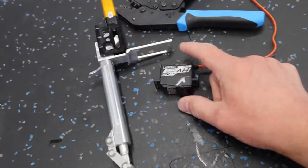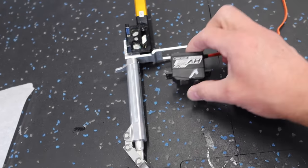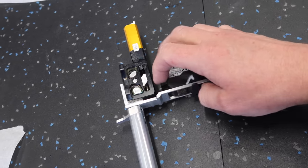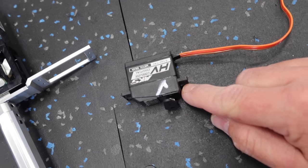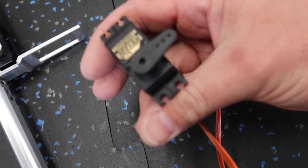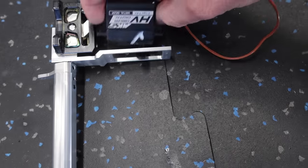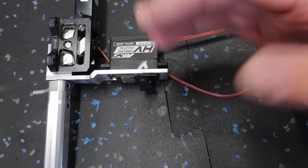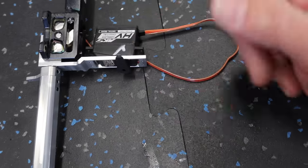And we are also working on our nose servo, steering and everything. So just getting this set up. Now, generally what I find with the Electrons is you get better geometry if the servo is mounted like that. These MKS servos have a little reinforcer piece right there in the center. Hopefully you can see that right there. What I do is just take an X-Acto blade and cut that off. Then when we put it through on this side, the geometry actually works out way better. Then we can use a clevis going from control horn to control horn, and it's just nice and straight and simple.